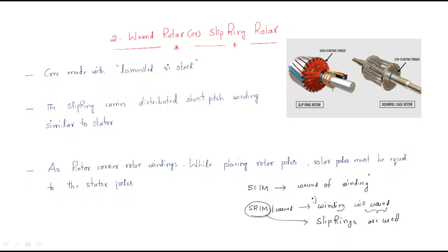These three are the slip rings. This process of winding is called the wound. The gaps are nothing but the slots, and this is the core. Compare this with the squirrel cage rotor: squirrel cage has a core and directly has copper bars — these are the copper bars.